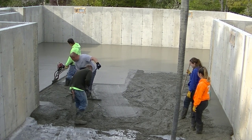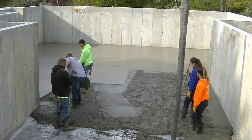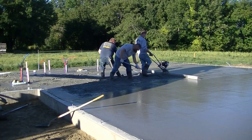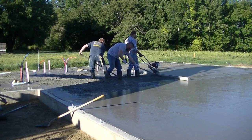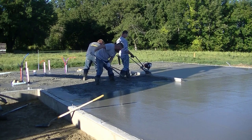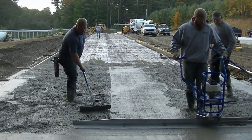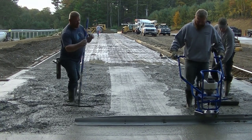This is one I used in the past — one of the first ones — it's a Viber Strike. It worked good and I used it for a lot of floors, but what I didn't like about it was the handles. You can see they're straight, which was pretty tough on the wrist. Compare that to the Screed Demon — you can see how the handle has a little bit of curvature to it, which makes it easier on the wrist and your wrist doesn't get as tired running it.